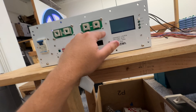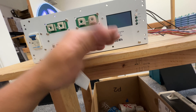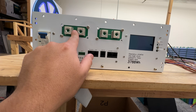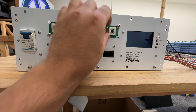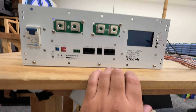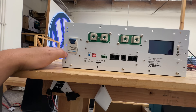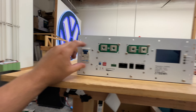I'm going to use a PCB on the front panel. I might back it with a metal plate and use the PCB as the front face so I can have all the labeling on it and also for isolation purposes, because these terminals are live positive and negative. I want to overlay small color-coded boards — black for negative, red for positive — slightly elevated so it's really easy to tell which post is which. FR4 fiberglass board is a good insulator, so that's going to be the approach.